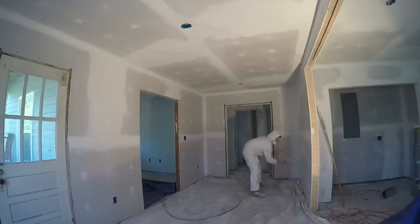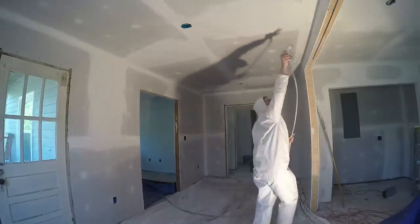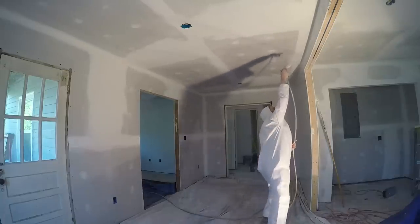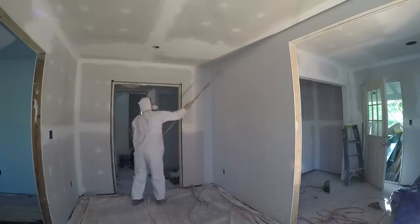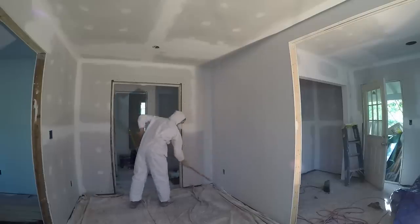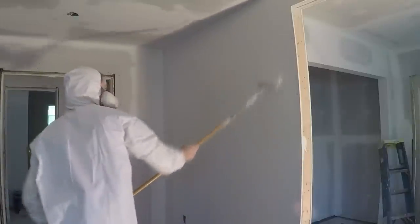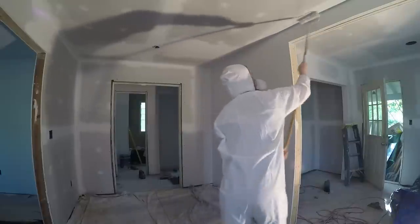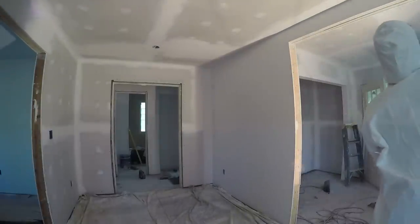I slapped on my painter's costume and got going. This is one of those 3M or Tyvek painter's suits — it's a one-piece, like a little onesie for painting. I'm just spraying on the paint and then going back over it all with a roller — not dipping it in a pan or anything, just rolling out the surface. It's called back rolling. It helps the paint adhere better to the wall and evens out any splatter or uneven painting that comes from the sprayer. In general, painting with a sprayer is very even — you don't end up with roller marks, and it's very fast.